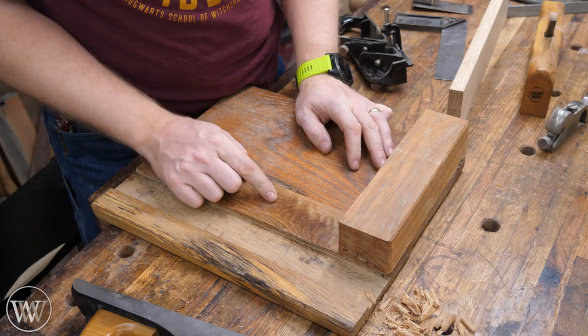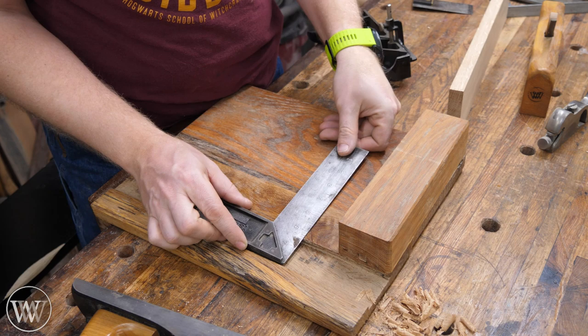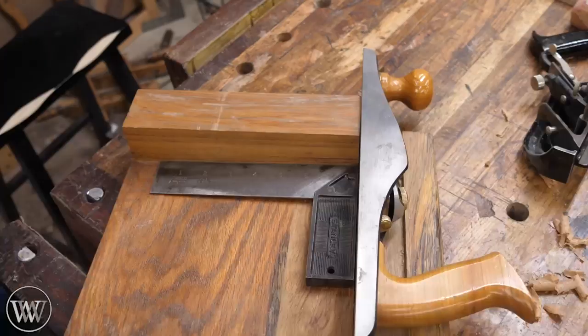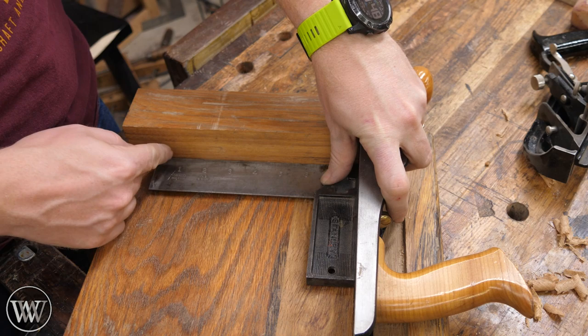The problem is wood moves. After having this for a few years, this is no longer exactly 90 degrees. If I put my square in here, I'm off by a shaving or so from one end to the other. So now when I plane boards, they're not perfectly square — there's a little bit of a gap on one side or the other. We can put the plane in place and put a square up against it, and we can see there's a little bit of play. I need to take off more material up here and no material at all at this end. But how do we do that when we're right tight up in the corner?